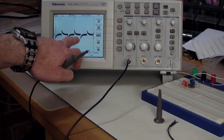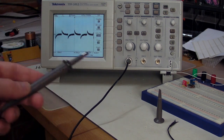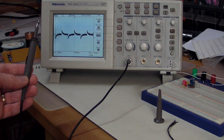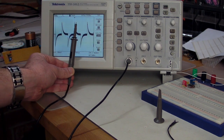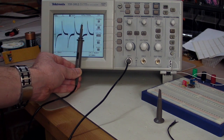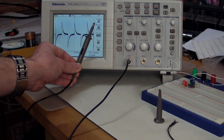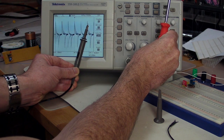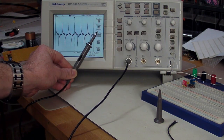And you're wondering what this little waveform here was, which we caught a glimpse of there. It has nothing to do with this shock response, but I thought I'd show you this anyway, because it's another rather interesting effect. If you put the probe near the screen like that, you can pick up the backlight signal. You can pick up the EMC from the backlight on the screen like that. And it's rather interesting that each oscilloscope will have its own specific waveform for the backlight inverter.